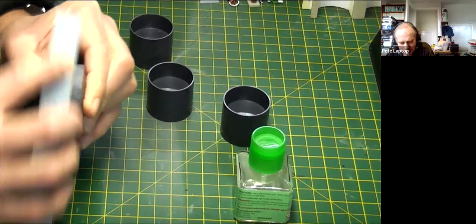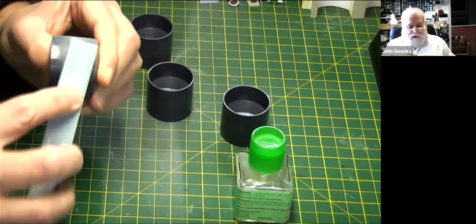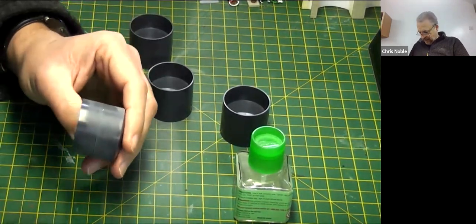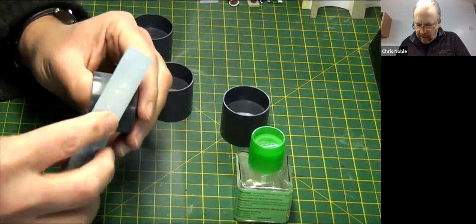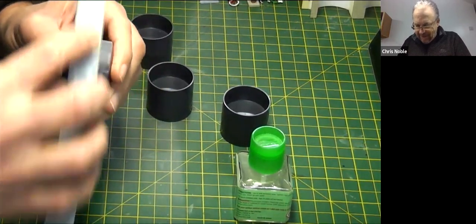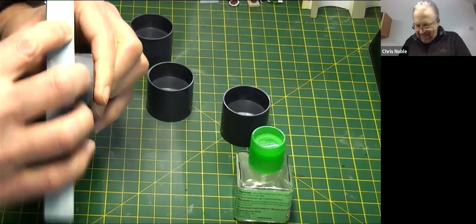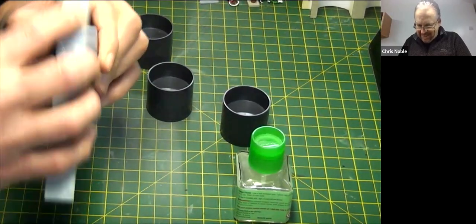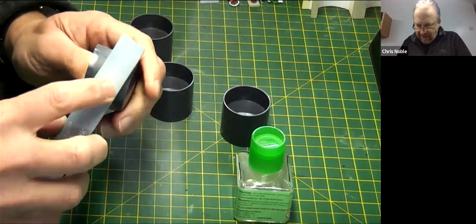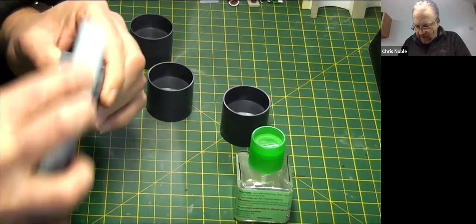So you're sanding that quite quickly after you've applied the... Oh, yeah, the glue's, the solvent's gone. It doesn't take long, John. I've always had a bad experience of doing that. Have you? Well, I've ended up, it seems to drag. Oh, yeah, if it's dragging, then... Because I've put too much adhesive on, I think. If it's dragging, then you're clearly going at it too early.